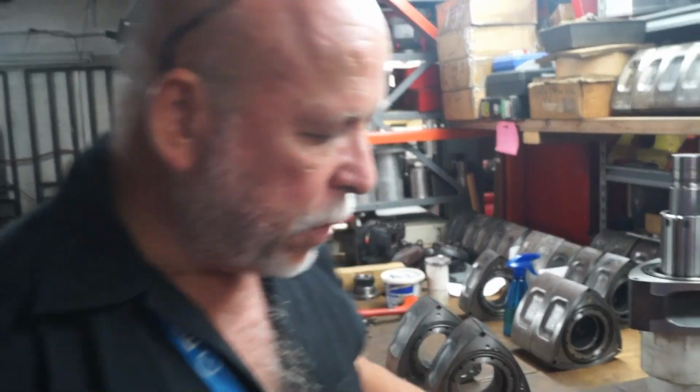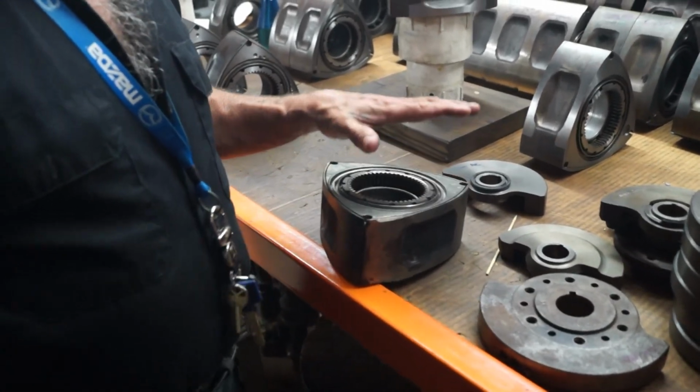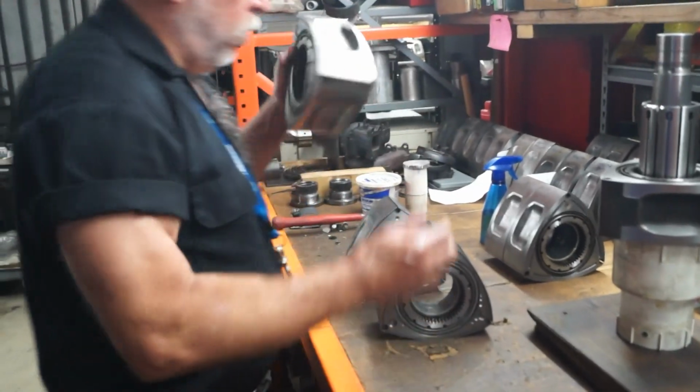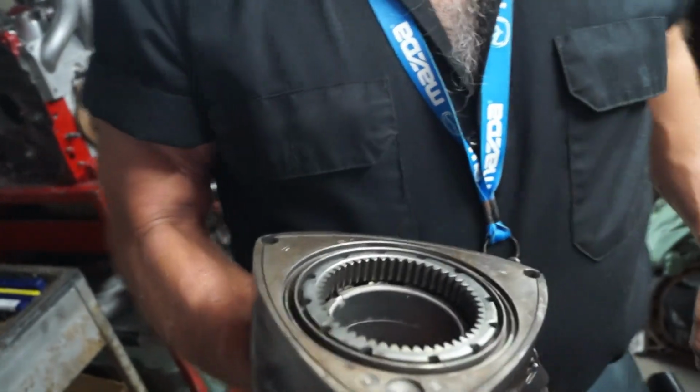Well, yeah, but you know what? There was a reason why they couldn't balance the rotors for the RX8. They're so thin, and besides that, it's that side exhaust port. If you don't run the engine hard, and most people don't, the minute that these pockets would get full of carbon, they'd start scratching the side housings like a cat on a leather couch. So to prevent carbon buildup by the exhaust port, they eliminated it, and they live with it.